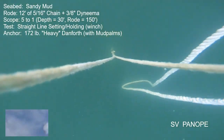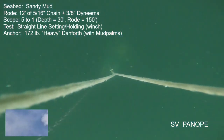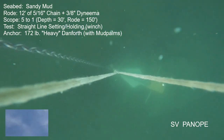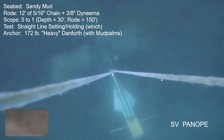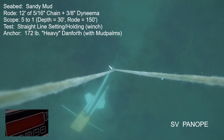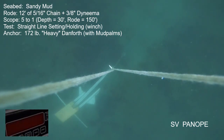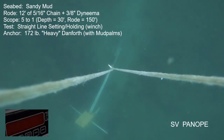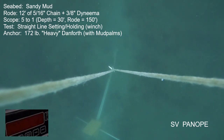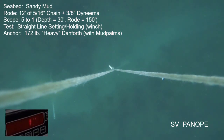There's little doubt the palms improved the anchor in soft mud, but what about other seabeds? This is my normal sandy mud seabed, where we get much better pictures and I can use the winch more effectively. The owner indicated the anchor sets and works fine in more firm substrates, but I wanted to see how it performs and make sure the mud palms aren't inhibiting it. We saw the anchor set nicely — the articulating motion happened in slow motion as the throat angle opened up. The anchor has a bit of a list, and in the lower left we see the digital readout of pounds of pull in real time.